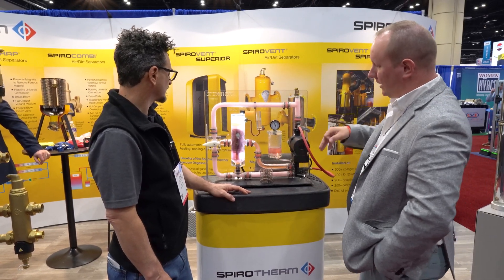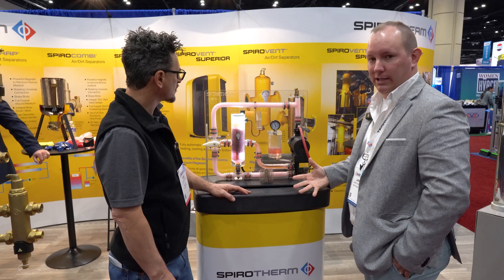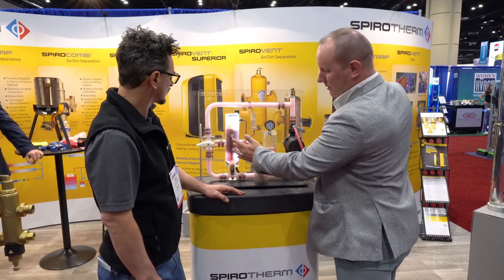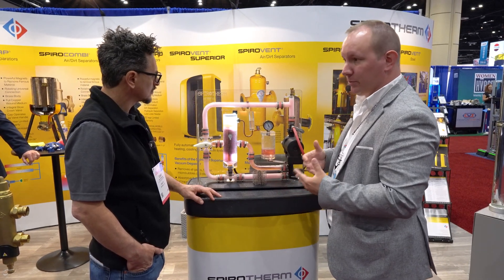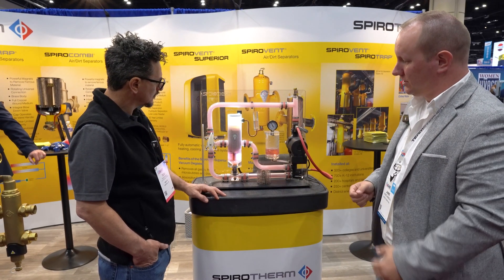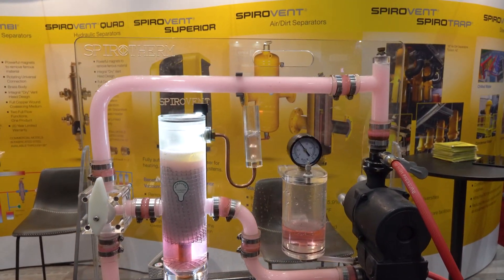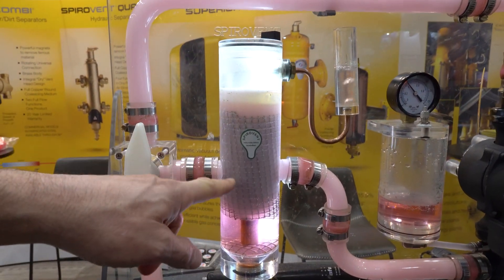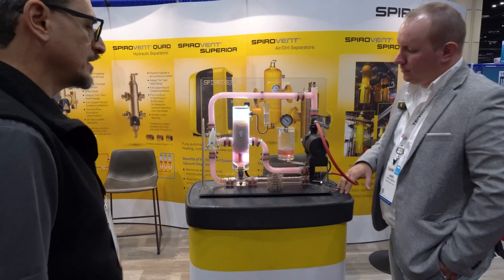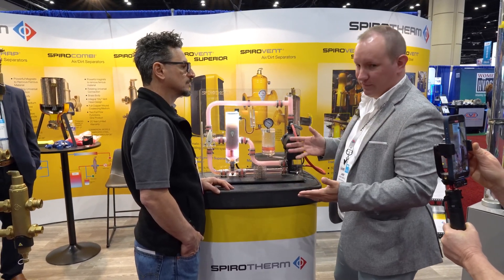As you can see, I mentioned that cotton candy look — it almost has a swirly look to it. It's not really cotton candy — it's glycol. When you have pump cavitation with glycol, it turns into foam everywhere. So when I flip this valve, you'll see a big foam cap — but it's just bubbles. They are where they're supposed to be. This one takes longer — it's a viscosity thing — but you can visually see it a lot better. You can see all the foam inside it. Eventually all these air bubbles will come out. Cotton candy is a good description of that color.